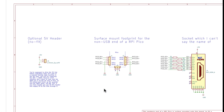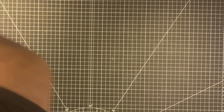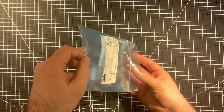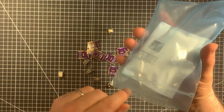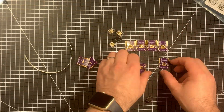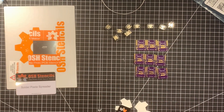The thing I like about this is the circuit diagram — it's really simple. It only uses eight IOs from the Pico and then simply 270 ohm resistors on each one. Now the problem with it is it's actually quite hard to make. It uses very fine pitched components; those resistors are tiny and you need to be doing surface mount soldering.